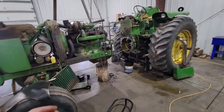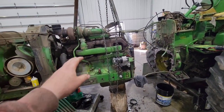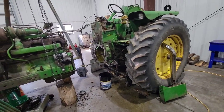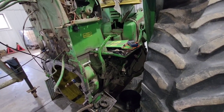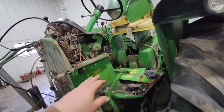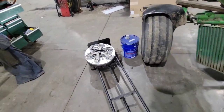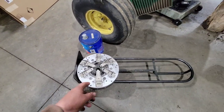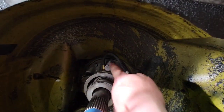What a great tractor — kind of a 4020 front axle and rear end with 45 and 4620 kind of power. Just a hot rod, sweet tractor. So you just had a few little things. One thing: if you've got this lever on a 20-series tractor, that means your PTO is right here. That's the bearing that pushes against your fingers on the clutch. Look how pretty that clutch is — rebuilt. They use the center of the existing clutch and just put new pads on it. It turns out nice. It's hydraulically activated, and these are the return springs.